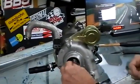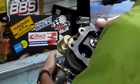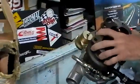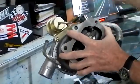Spinning the impeller, we had a slight touching of the steel impeller to the outside aluminum housing. So we flipped the unit over. You'll find indexing marks on the back — see, these are aligned right now. They were off about a quarter of an inch.